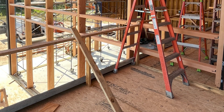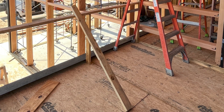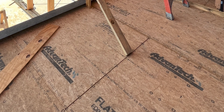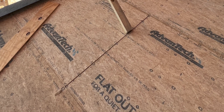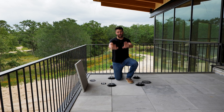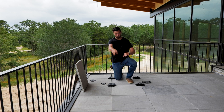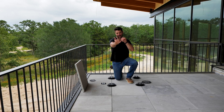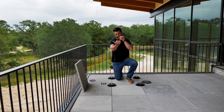Step one, we made a butterfly roof. Underneath me here is an actual butterfly roof. We use Advantec decking — an inch and an eighth Advantec — and this, where I'm at right here, slopes towards you, and then where you're at there it slopes back towards me, and we've got a linear drain here in the middle that is a gutter for both of these to run together.